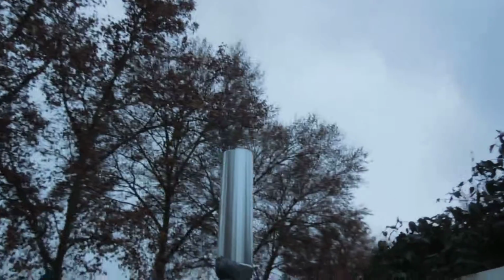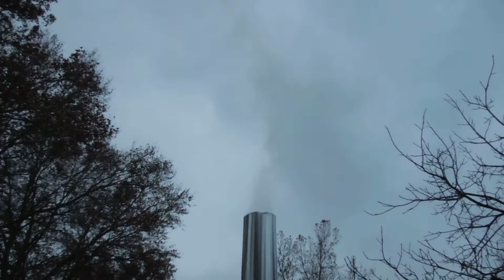And there's the other door back on. I'm gonna come around here and see there's absolutely no smoke. A little bit. I probably shut the door too tight, that's what I did. I don't have the holes done in the draft yet right here. I'm going to put holes behind here so it'll draft right through there. On the glass door I build, I'll probably put some vertical slots there with some vents that'll open up. I don't know. That'll be another day. But yeah, there's a little smoke, but all I got to do is fiddle around right here with these drafts a little bit and figure out where it's set at good to eliminate that smoke, and she goes away.